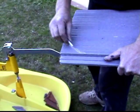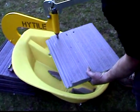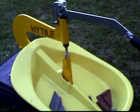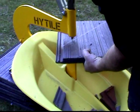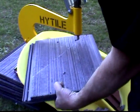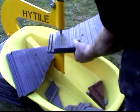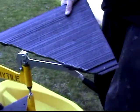Hip cut. Now this is the finishing side of the hip cut. A few taps in the thick part of the tile, and shorter sharp ones in between the other ribs. And if you get something like that, just a quick trim up brings it back to perfect.